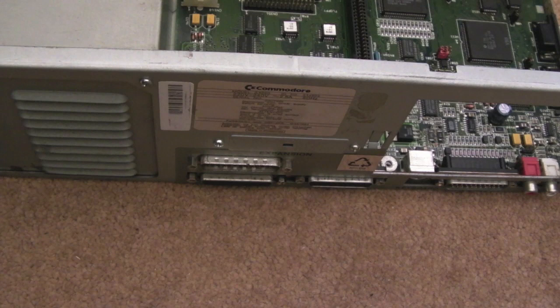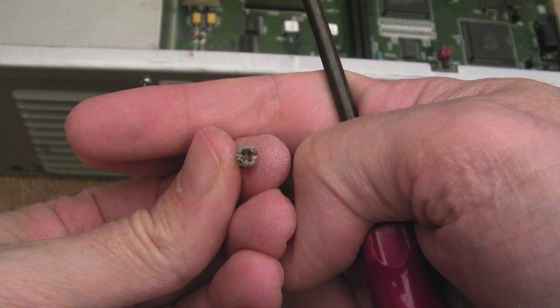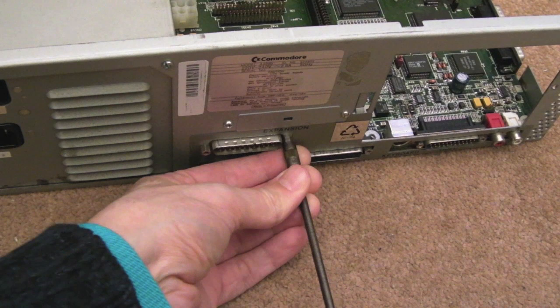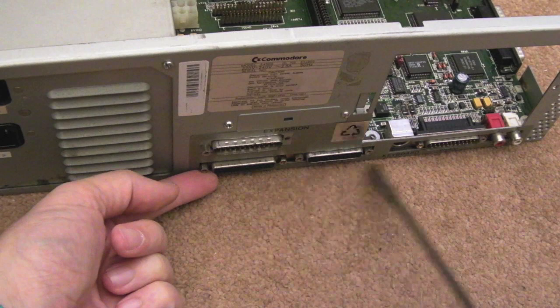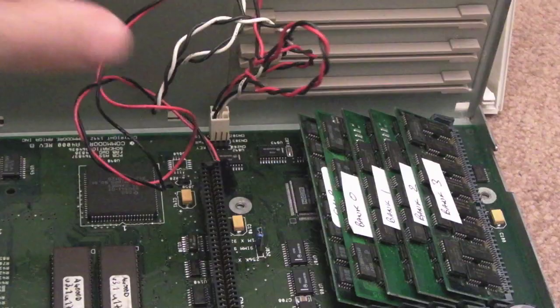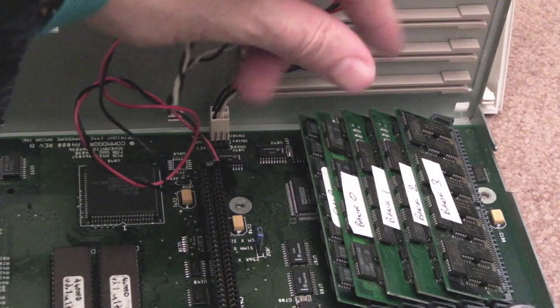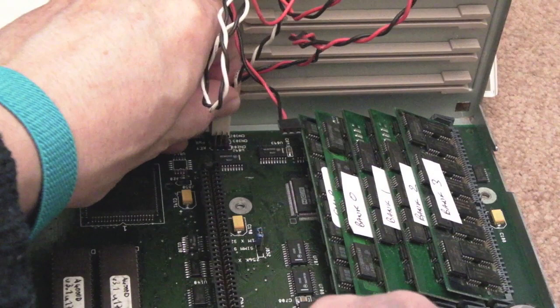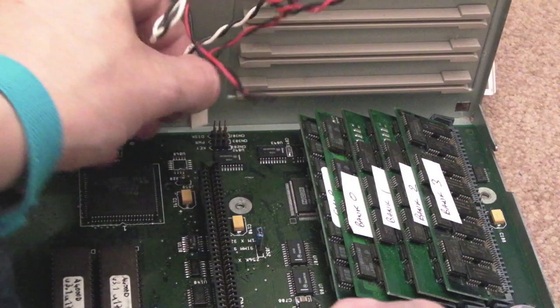Look at the state of that screw, one of the screws that was on the board. That wasn't in the corrosion area, but it was originally, I think. They're not even cleaning that up. The next thing we need to do, I think, is free these nuts up here, because this is part of the motherboard. These ones down here will just slide out of the case, but this top one is held in place. Let's see if that will start to come out. Yeah, it will. Over the front side there, we need to disconnect these two. Let me work out which one's which. The white one is at the front, and we have no pins at the right hand side, so that's easy. That one said power, and the bottom one says disc. Just move those out of the way. You can put the whole front panel piece somewhere out of the way.